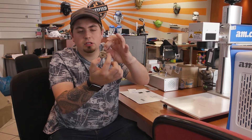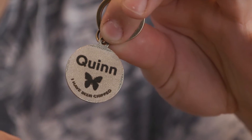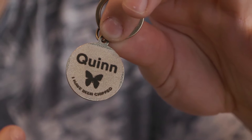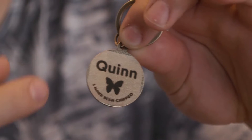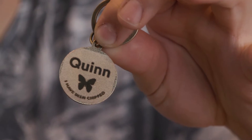There's only one issue that I do see — around the sides here you can see that some of the dark area of the metal where it wasn't engraved is still there. Because you're using a bitmap it still has its background, and because I designed this on a rectangle background it then obviously engraved the rectangle area as well, which has left out certain pieces on our dog tag. Now if you used a vector file you wouldn't have this problem. So I'm hoping that you learn from my mistake.